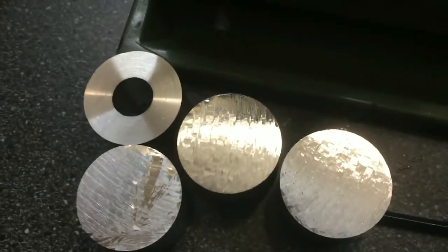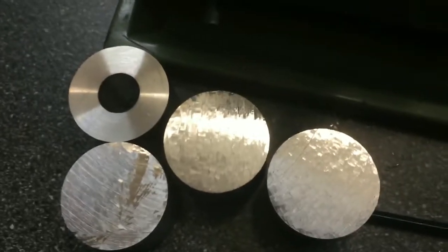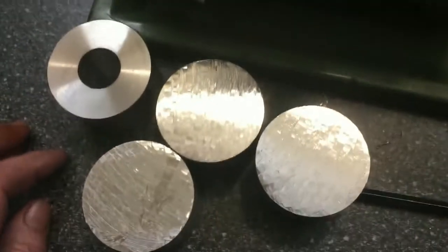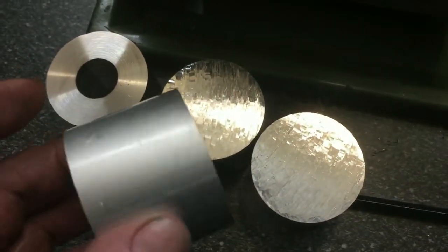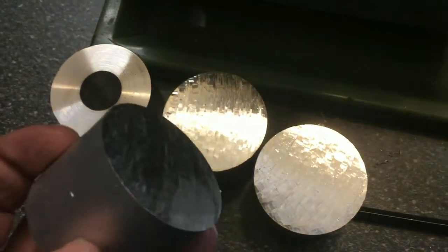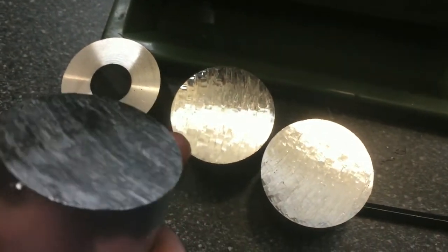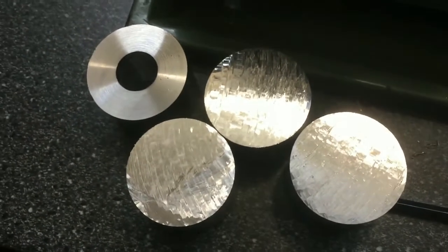Got a little production job which involves turning on a mandrel. You don't see much turning on mandrels so I thought I'd share it with you all. Aluminium blanks, 50mm diameter, cut off on an Evolution chop saw. I've got to take it very gently because it'll clog the blade. I spray WD-40 on it, and chopped off — it'll cope with 50mm diameter.